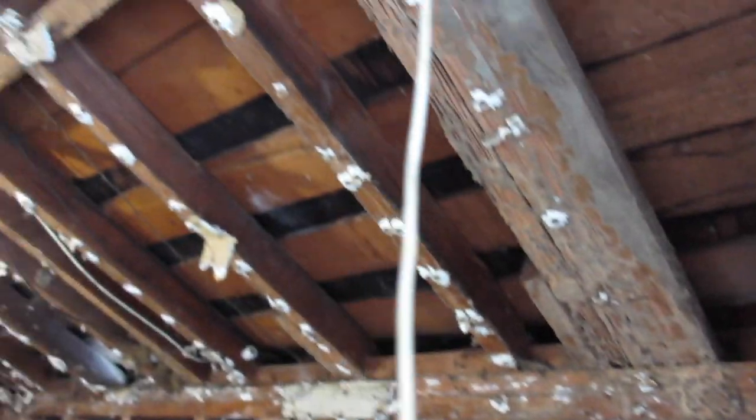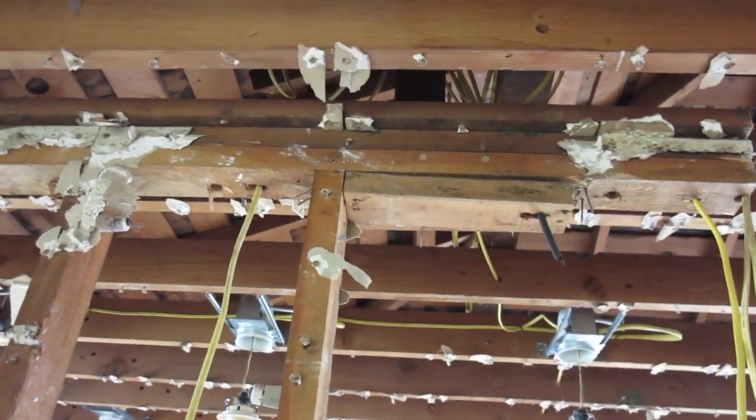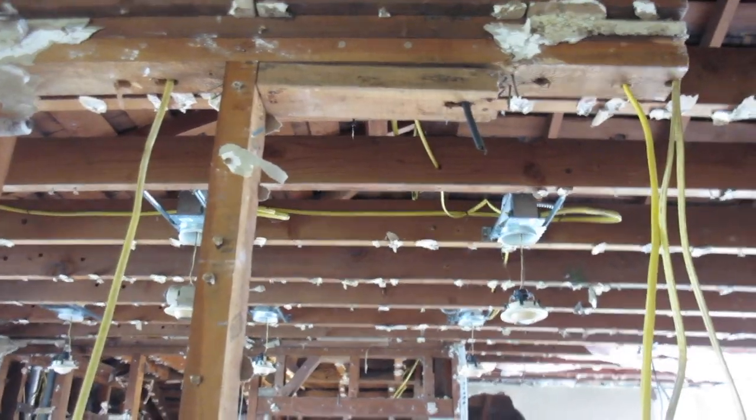We took this closet out because the termites, you know, they got started for us and said, why don't you finish it off? So I did. I was able to remove part of this wall, but then I realized I got a little something above there. Leave it there until you can get a temporary leg all the way, just in case it's really holding something, and when you put the beam in, bingo, you leg it down to the beam.